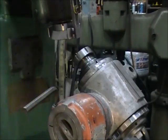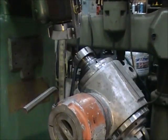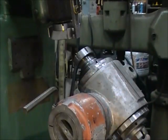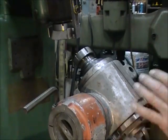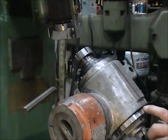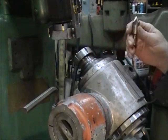It's pretty easy to set these things up because the head tilts over real easy and you can change the angle of the head, which is real fast to do. It's just a neat grinder — if I get a chance to pick up another one I'm going to. There's a little index finger down here which grabs these little notches as you turn — you just count them. Turn it six clicks you've got six flutes, turn it four clicks you've got four. You're indexing and lining your cutter up when you tighten it up. Pretty slick — I love it.